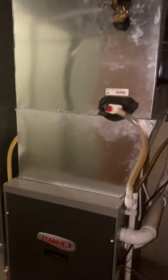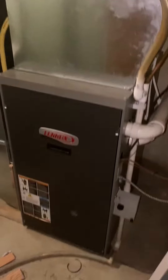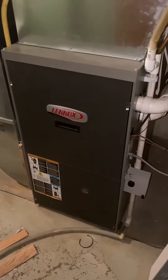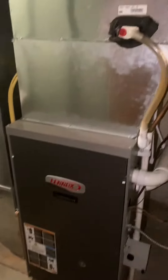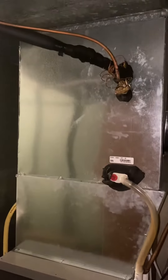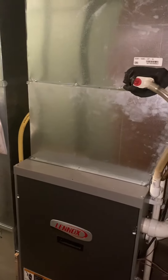We're looking to do an AC swap down in the basement here. The coil is pretty straightforward — the Lennox unit is all standard sizing, so we'll end up doing a C-width coil, it'll pop right on there. The coil is actually above the sheet metal, so we'll just have to pull out the sheet metal — it's about 24 inches wide — what it's joining to on the supply side, so we'll just have to fan that out up above the new coil.